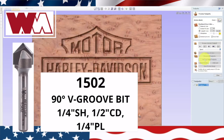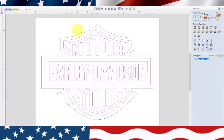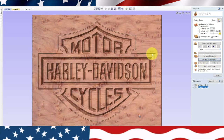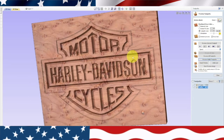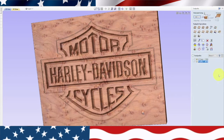Let's preview it — and that looks really good. Let's close that and go back over to 2D. Now we're going to highlight the outside one and do a profile toolpath. We'll use this eighth inch bit again and go down an inch, keeping everything the same. We don't need tabs because it's not going to go all the way through. We'll put in number 4616, hit calculate and preview — and you can see that cuts down through. So we'll be able to cut this and then run it through our profiler. Let's close that and I'll see you over at the machine.